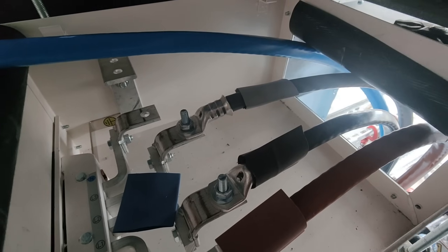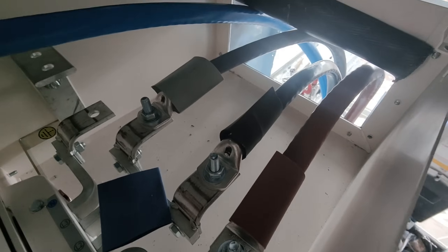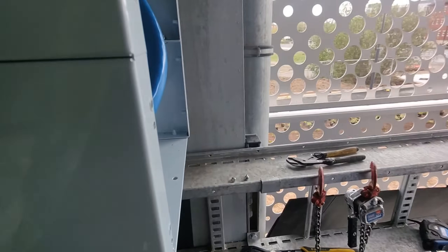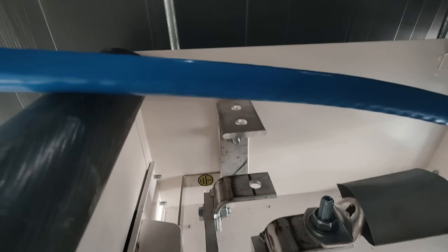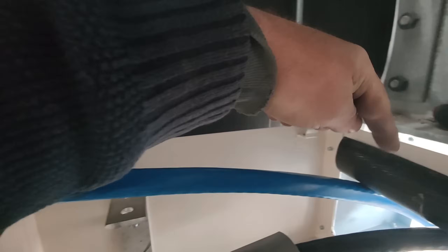So that's that one in. Now this isn't the neatest job I've ever done, but obviously there's a reason for that - it's bloody hard, that's why. I'm going to get that last one in now, get the lug on there, get a measure, and pull with the little contraption I've set up to set the bend. That's quite close - I need it to go in a little bit more, so I'll pull that, get it set, get the crimp, get it connected. Then I've got to make the fly lead, which is 95mm by the way, down into the little blue box and over onto the banjo. Right, it's done.